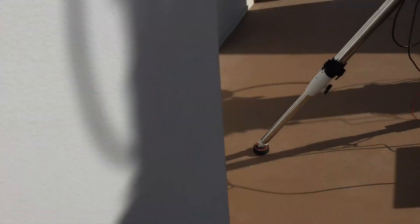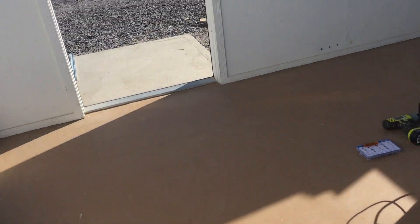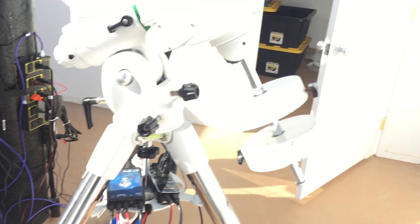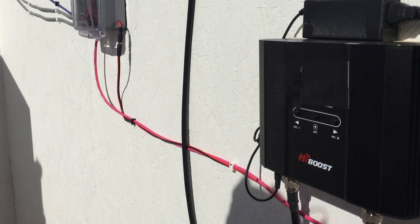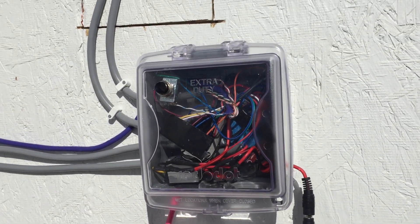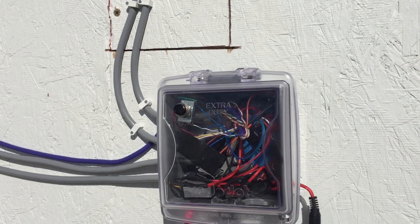the Arduino basically pings our LAN power box. If it can't ping that, it has a timeout in it and it tries pinging multiple times. After 15 minutes, it basically just tells the dome to close.